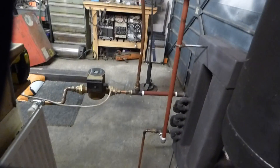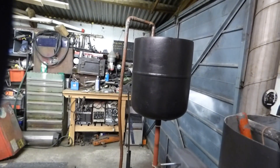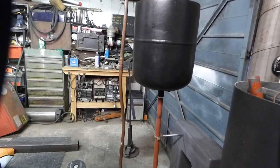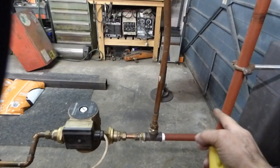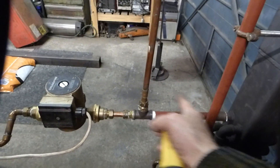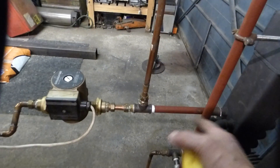There's the pump and the header tank, and that's the open vent. Whatever you do when you're playing with water, you need an open vent — it can be dangerous, you'd be building a bomb. That's a half-inch open vent. The cold feed is here, and between the cold feed and the open vent you need a minimum space of 200 millimeters. When it comes out of the boiler, that's what it's going to be, then there's the pump and we go around to the radiators.